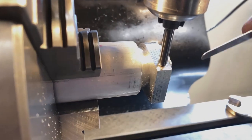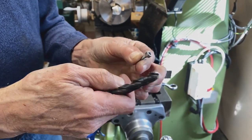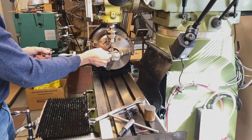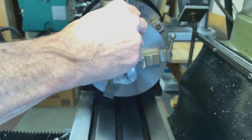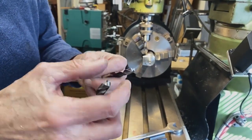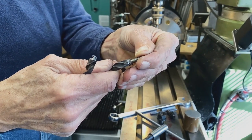I should see equal space on all three sides. I need to make room for the head of the Allen screw, so I use a regular drill. I need a good starting spot because it looks flat but it's at an angle of 10 degrees, and if I start to drill, it wants to make the drill wander — it wants to push the drill to the side. So I need to start this drill straight, then take it out. See how it faced off this spot? It's pretty flat. That makes a good flat spot for where the head seats against.